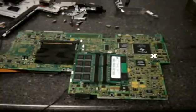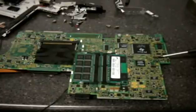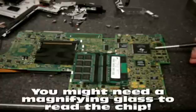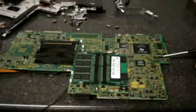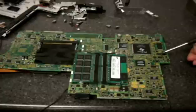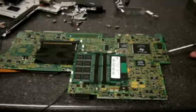Let me find them for you — there are small little chips. There he is, that's the culprit. It's in between this big chip and the network chip. So the chipset, the actual bus, and the network chip — right in between is the little Atmel chip. On the chip it will either say KS24C02 or 24C0. Basically what you're looking for on this little eight-legged chip is a '24' on it. All the other ones have different writing, but that's what pops out to you. This one actually says KS24C.